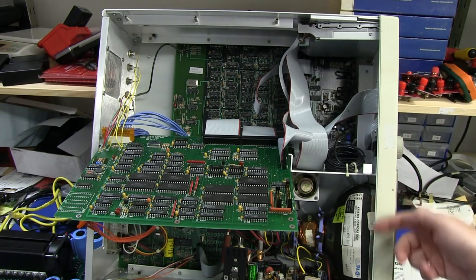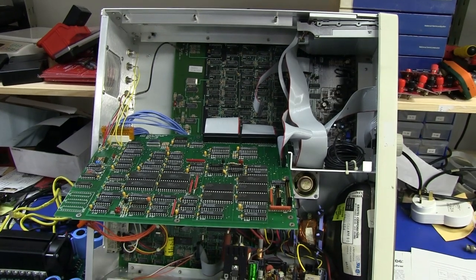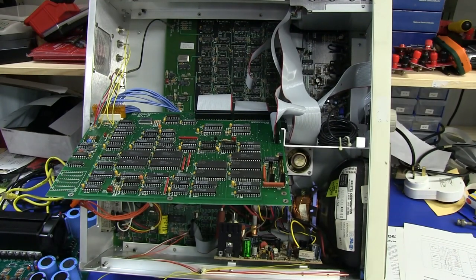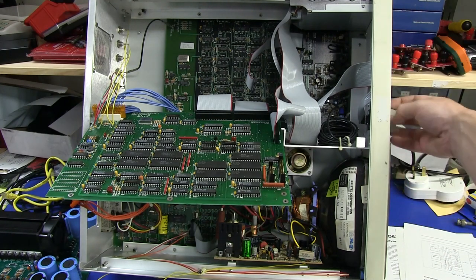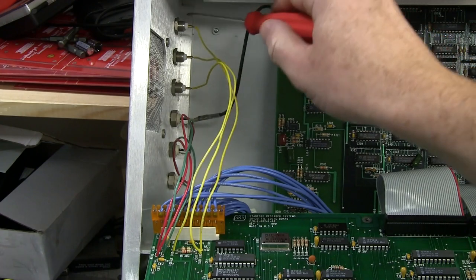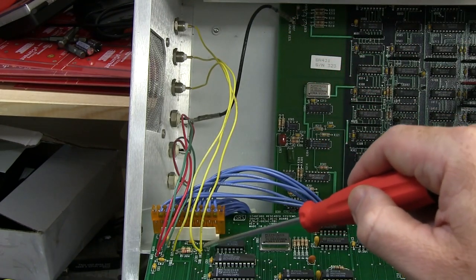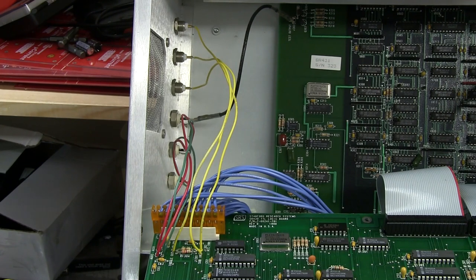No one wants to pay $8,000 and get some little pokey box — you want a big huge box, big CRT, lots of buttons on the front, and a big twiddly knob. Done it again with the permanent wire connection — they've soldered these BNCs here. There's no ground on those at all; they're just relying on chassis ground. And there's a single wire running off, directly soldered onto the PCB. Apart from that it's quite modular, all connectorized — and they just go and do that.